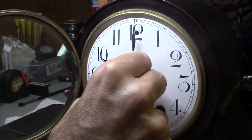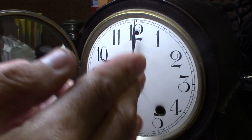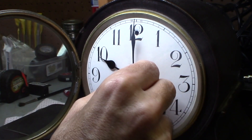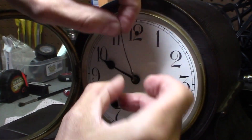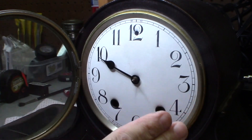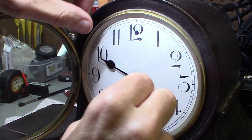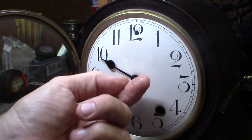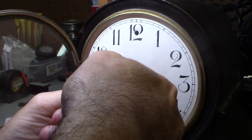Take off this piece — it's like a little washer. Save these two washers and remember what is what. This hand is at 10 o'clock — remember that. These hands usually just come right off pretty easily. Don't be afraid if they get stuck — don't force it, use a little penetrating oil or even just regular oil, let it sit inside there, give it a little force back and forth and it'll come right off. The hand is pushed on by pressure, so use little needle nose pliers and just wiggle it carefully back and forth and it'll come right off.